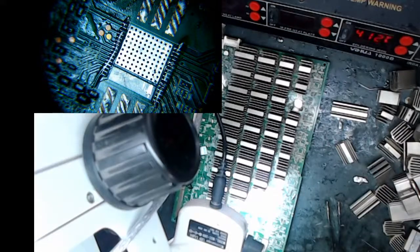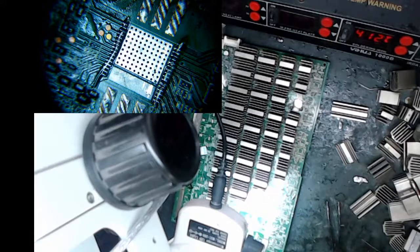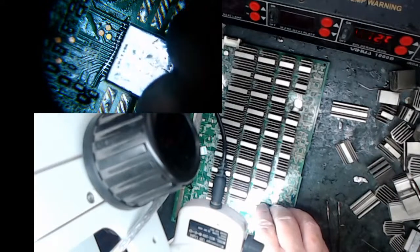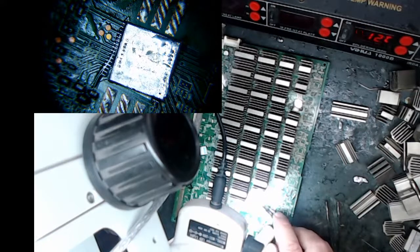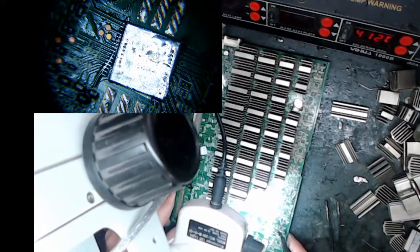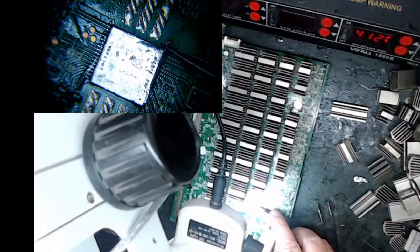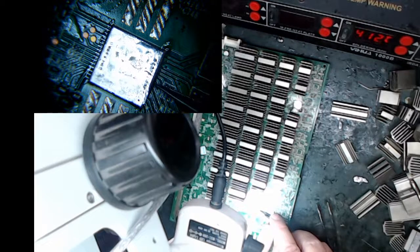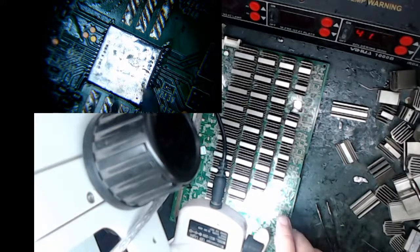I've got a chip. And you can look at your chip and make sure he's tinned right. I'm going to throw this on. So, let's see. Just with your fingers. And I use my... Just center this again. Okay. Again, I keep this pretty precise. I don't move it once it's on the hot plate and once I put a hot air on it, so I kind of make it perfect.